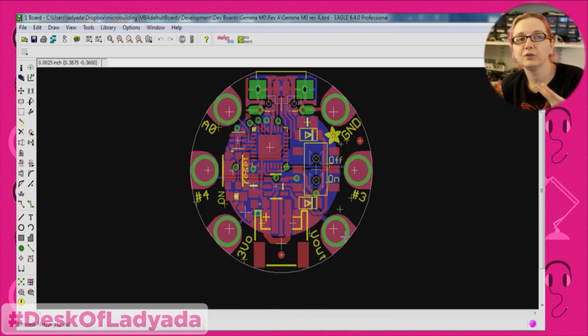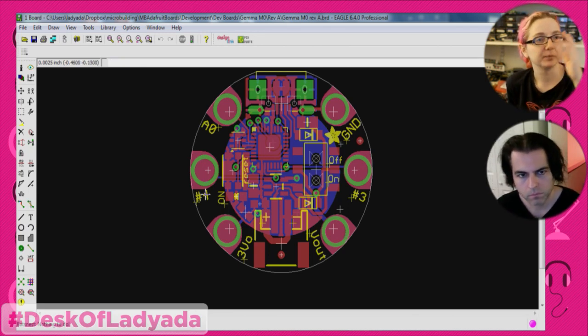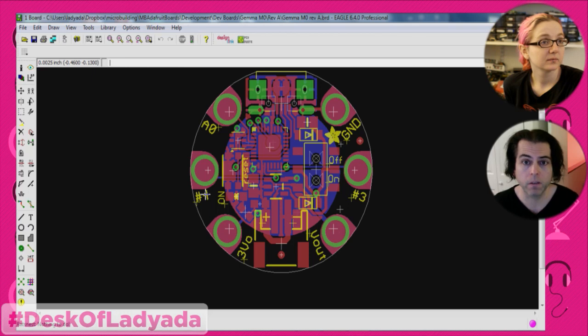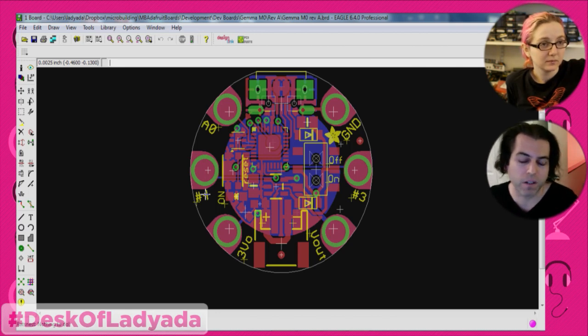This could be good for wearables — why not make it even easier to do wearables? There are lots of workshops specifically teaching wearables, so is there something that makes teaching wearables even easier? If we're really going to teach people computer science — with hardware as a nice side effect — this is an interesting strategy. I don't have any code for the ATSAMD21 E18 yet, but given it's the same RAM and flash as the G18, code-wise it's very similar and won't be too difficult to port Arduino support. Maybe the Gemma will slowly be discontinued a couple of years from now, because the Gemma M0 does both and has about 60 times more speed and RAM. You get hardware I²C, analog input, and analog output — no restrictions whatsoever. We like to come up with products that compete with ourselves.